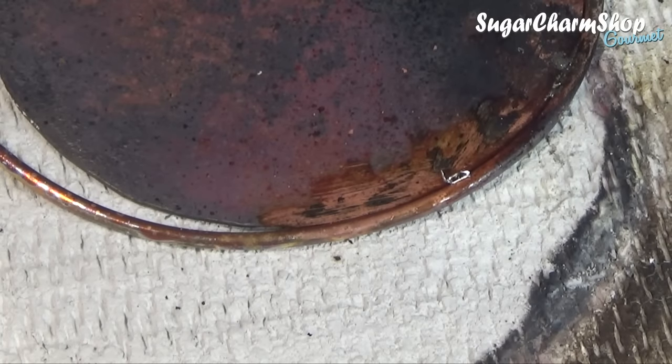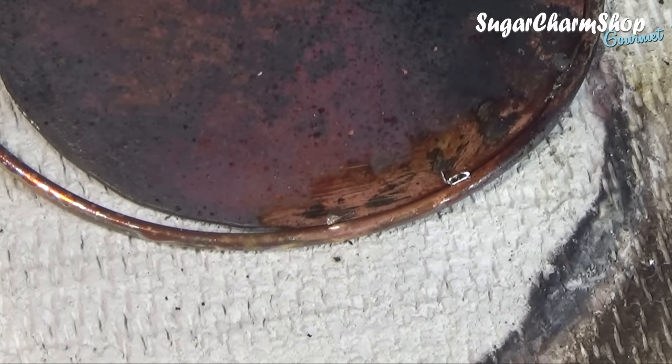I first used the larger flame on the pieces to weather them or make them look really old and rustic, especially on the tabletop where I wanted the heaviest layer of patina because in my opinion it's going to look a lot better than having a shiny copper base. The process is then basically the same as in the cooling rack tutorial: apply any flux based product of your choice, then place your solder and use your torch to melt it.